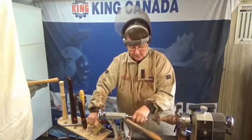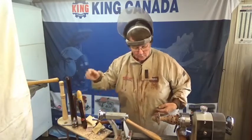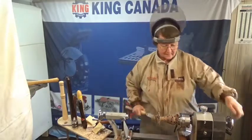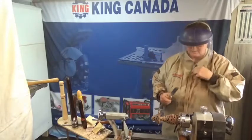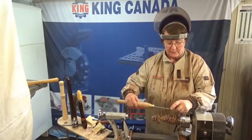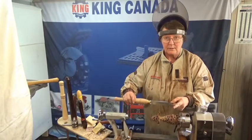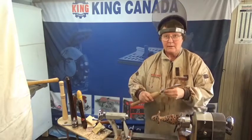Now, take this out so I don't stab myself with it. I hope you notice the nice little tray I made for the back end of my lathe. Okay, it's all clear. Now I'm going to part it off, and I'm using the Sorby parting tool. The tool has a flute here on the top. You only sharpen this little bit. I have had students sharpen my flute right off. This one I don't let them have.